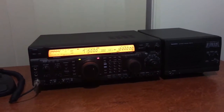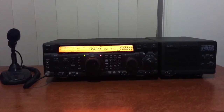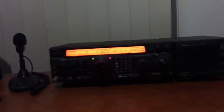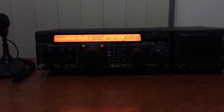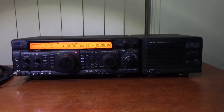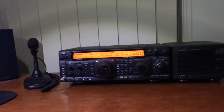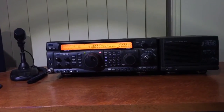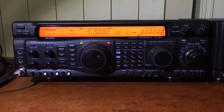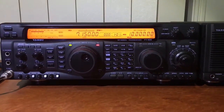Hi guys. I just wanted to do a quick installation video of the options for a Yaesu FT920. The options I have are the FM1 board for FM mode, the wide filter for AM which is model YF116A, and the CW narrow filter which is YF116C. Since these options have become unavailable from Yaesu while they're still selling the radio new, they've become hard to find and pretty expensive on eBay. I waited until I had all three before opening the radio so I didn't have to open it three times. I thought I'd do a quick view of the inside for someone considering buying these.